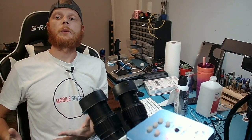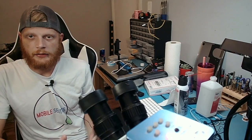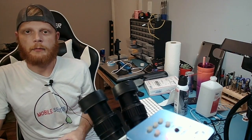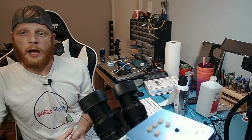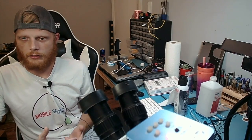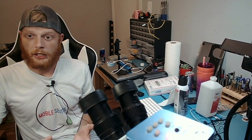All right, so while we wait for the board to cool, the first thing we're going to expect if we failed is a main short. If we plug in a DC power supply and it immediately draws 4 amps, or however high I have my DC power supply set to, then we know that we messed up in that reball. I have a suspicion that I messed up there and I'm gonna have to redo this whole process because I nudged it early and I nudged it in the wrong direction. If I nudged it towards me, it probably would have been okay.